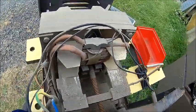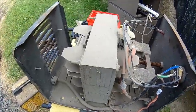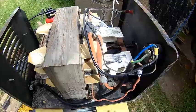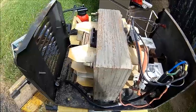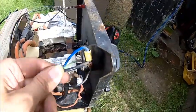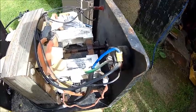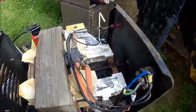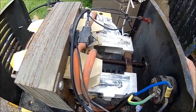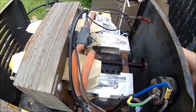That's a thermal switch. Maybe we're going to replace that switch at some point. It looks in pretty much original state. So we gave it a bit of a clean and it looks surprisingly good actually — the metal parts are a bit rusty. I just noticed the other pole of the switch doesn't work either, so we need to replace the switch, because it will always be powered. The current setting on these cheap welder boxes is basically done by changing the losses of the transformer.